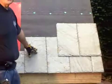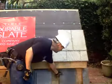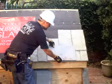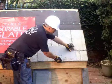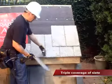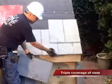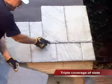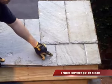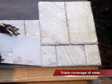Right now I'm going to show you how this roof works. The very bottom row is this 12-inch piece. You're going to actually have three and a half inches of triple coverage — you've got this slate underneath that you can't see, this slate, and this slate. And that's what keeps the water out, because water can't penetrate this stone.